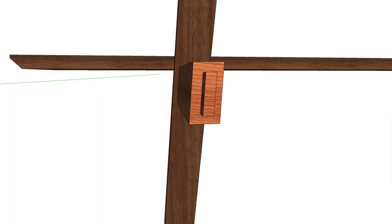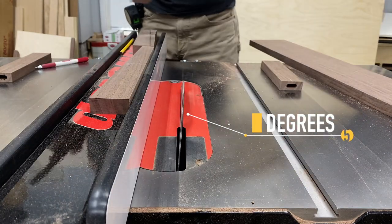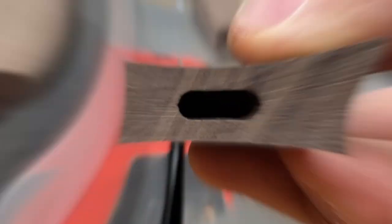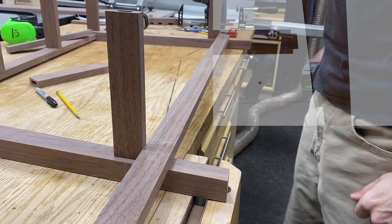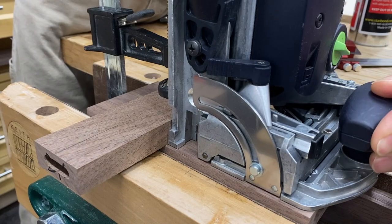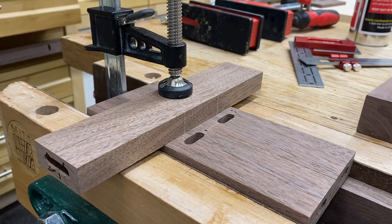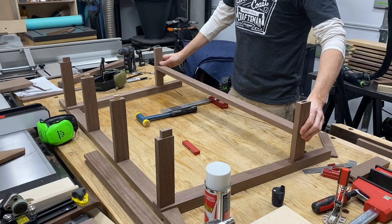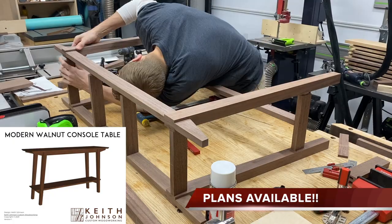Since the face of these stretchers are parallel with the outside of the leg — which is five degrees — the top and bottom edges need to be cut to that five degrees so that the shelf sits flat on it. To measure for the long stretcher that connects the two outer stretchers, I'm using relative dimensioning — basically taking my workpiece, putting it up there, marking it, cutting it, and then firing up the domino again to cut those mortises. And while I do another quick dry fit to make sure all parts harmonize, I wanted to mention that plans are available in the description below if you're interested in building a walnut console table of your own.